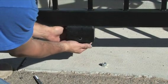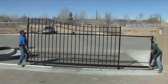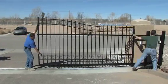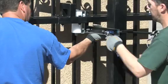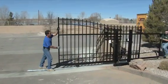Bolt the 2 V-groove wheels to the wheel boxes. Then place the gate on the V-track with slider guide rollers inserted within the guide rail. Final adjustment will require the guide rail attach bracket to be approximately 1/4 inch above the top of each roller. The gate should roll freely back and forth along the track.